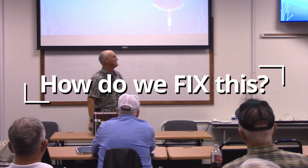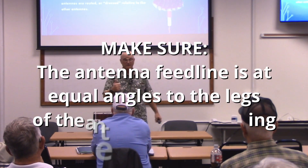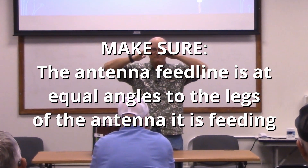How do you fix this? Well, it depends on how you dress your coax. What you want to do is make sure that your antenna feed line is at equal angles to the legs of your antenna. That way the RF field from one side, going in one direction, cancels out the RF field from the other side going in the opposite direction. Whether you're coming down splitting between the two on an inverted V or coming down at right angles on a dipole, it's how you dress the coax — that's how you avoid it. And for an adjacent antenna, how you dress the coax relative to adjacent antennas and relative to the antenna you're feeding will make all the difference as to how much RF gets to your coax to induce common mode current.